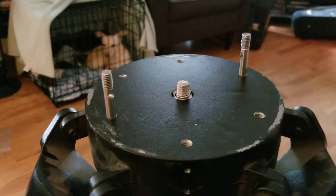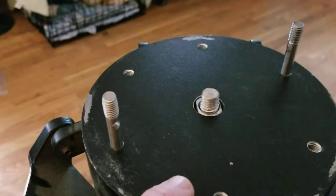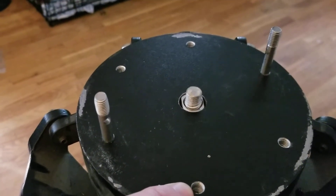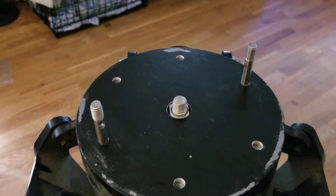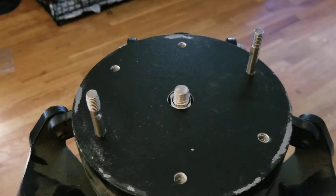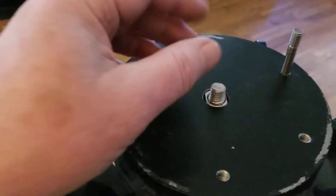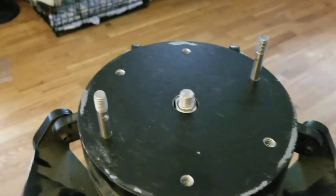The first thing I had to do was take these quarter-20 holes and basically just reamed them or chased them with an 8mm thread. This followed the threads really closely and these things are holding really good, so I did that to all of them. Now I can put it anywhere along here and any 8mm bolt will fit.